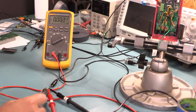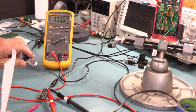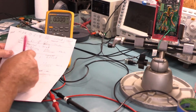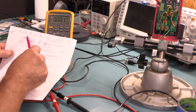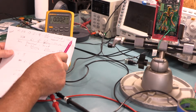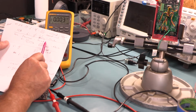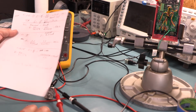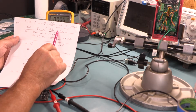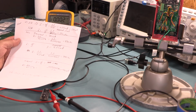And actually, this isn't the board that I tested this on. It was I think this one or something like that, but I'd done some other mods that I'll tell you about in a minute. But yeah, I calculated, okay, well, even at 10K, it should have only 330 microamps. The one I measured actually had 10 milliamps. I mean, it was an order of magnitude more than what I expected, right? And that came to a 330 ohm pull-up resistor.